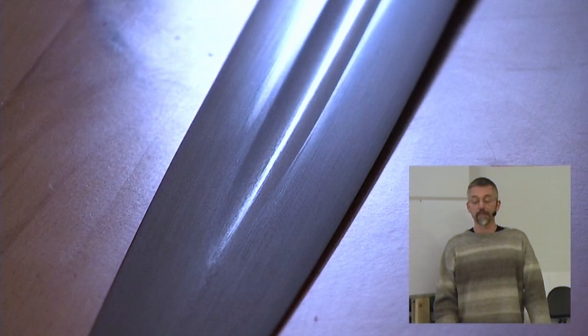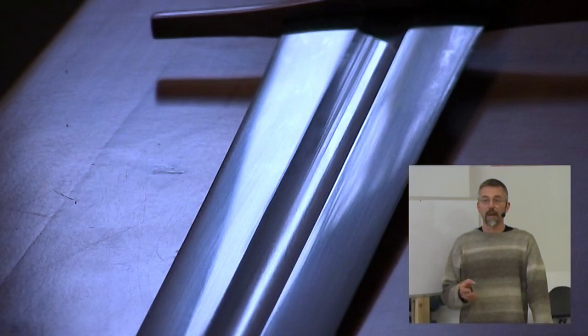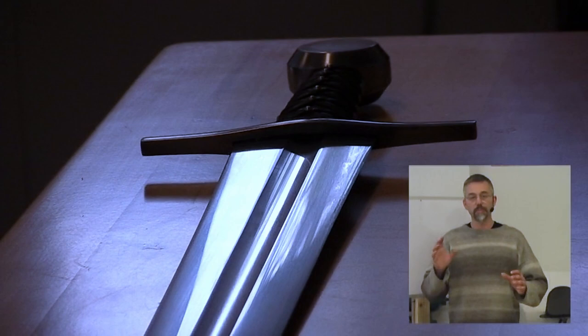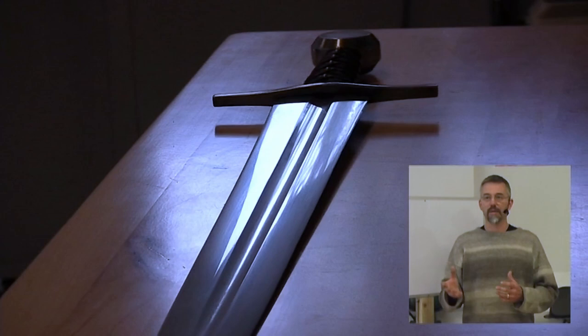So when I turned to sword making, I had something of this thought pattern ingrained in me, and I was thrilled to find in the swords, when I went through my documentation, that there are certain proportions that seem to be significant. You can find results of the golden section or root two proportions, and this is a great help when you design a sword today, because you can base proportions on divisions of some other part with the help of a pocket calculator. It's very handy, and gives you a door into the design results of medieval craftsmen.